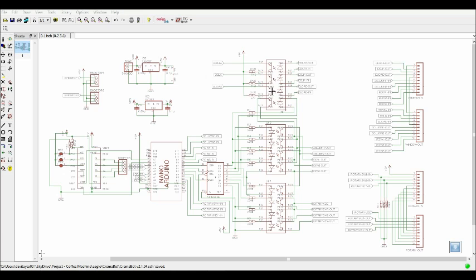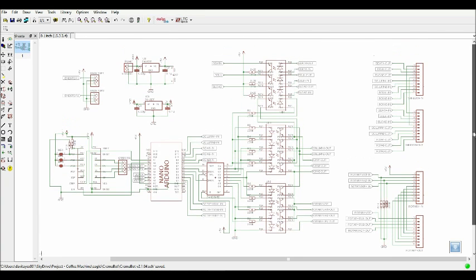with that. So those will be driving these optocouplers, which again feed straight into the Arduino over there, and I can then read the data out. I'm hoping there's no real crazy clock speeds happening there, and I can read it out with the Arduino successfully. Right, similar thing with the rotary encoders. Again, the rotary encoder plugged straight in there, and I feed those straight into the Arduino. And again, by the same 74HC595, I'm feeding those out and back into the machine via these optocouplers.